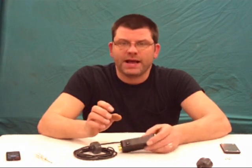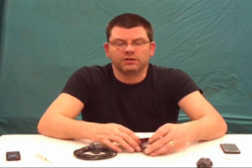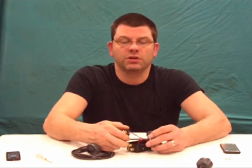And then I bought a pack of, I think it's a pack of 4 or a pack of 6 of 9-volt battery plugs that you just plug right into the top of the 9-volt battery. So I ran 2 of them just due to the fact that I get a little longer life out of it. So you want to make sure that you hook these up positive, positive, negative, negative. So it's still 9 volts.